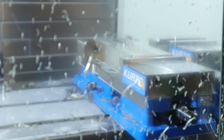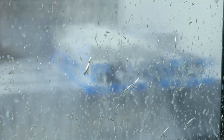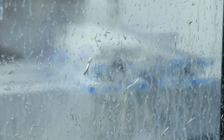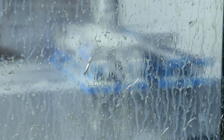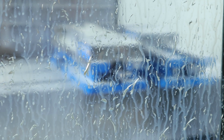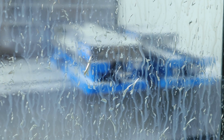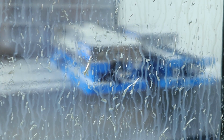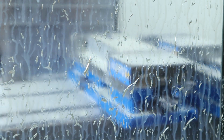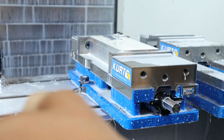Here we go. I don't think the clamp is over there. Huh. Interesting. Cut over here, boy. Okay, I had G54 set to the center of the fixture block, so obviously G54 is supposed to be this inner corner. Now we will try it.